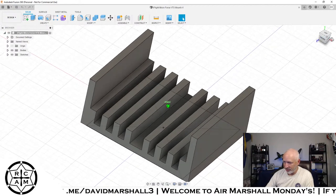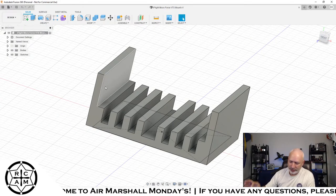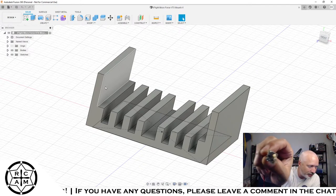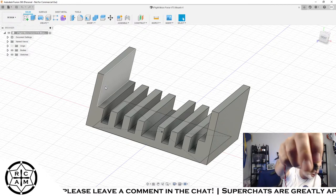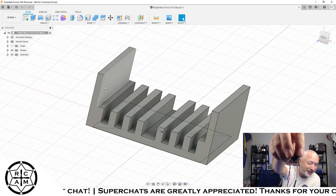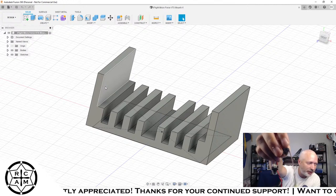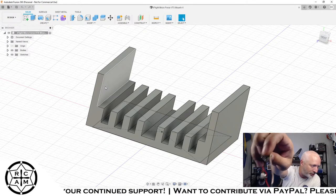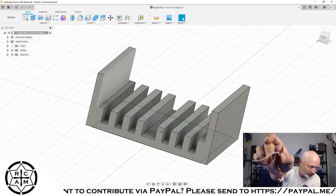All right. So this is the mount for the VTX, the small VTX, a small little unit right here. It's very tiny. It's like bare circuit board on one side, but I actually need that to be exposed because it's got the button on there. I don't have the ability from the transmitter to change the frequency and things like that on this unit for an airplane. I'm not running a flight controller or anything. So I have to change the output power and all of that using a little button on this side. So it needs to mount upside down. And that's how we're going to do that.